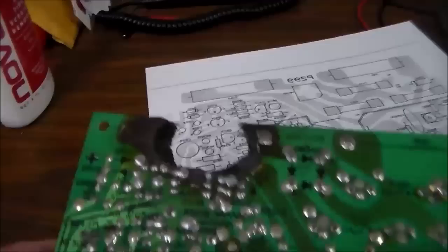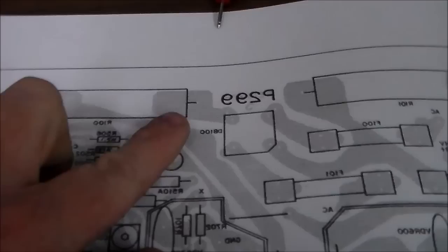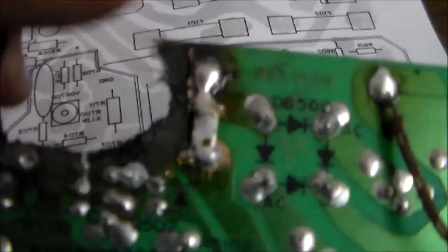All right, so the first thing I did was I got rid of the two resistors. So I cut the one off, and then the other one that burnt off. If you look on the thing, the way it worked was this trace comes up, and all it goes to is one side of the resistor, and then the resistor put it over to here. So we want this trace now to have a jumper just connecting straight to there. So since it's cut off about right there, I just made a jumper from there to there. And that will take care of that resistor.